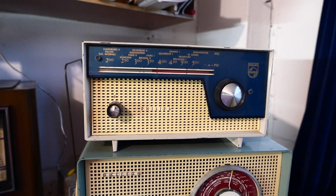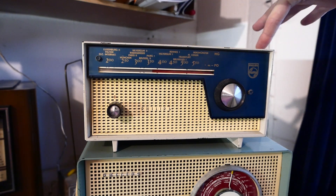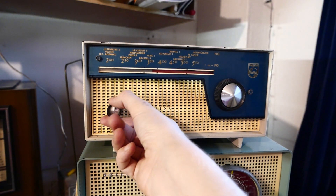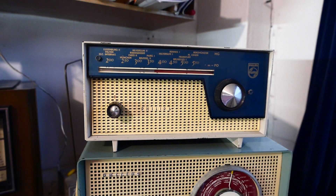It is a very basic radio. It only has one band: medium wave. It has an internal antenna, which is only a plate antenna — nothing more than an internal strip of aluminium foil. It has a volume control and a tuning control. The only luxury, in quotes, is an input for an external antenna.